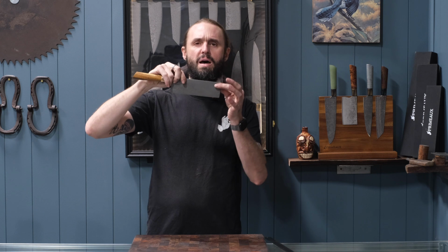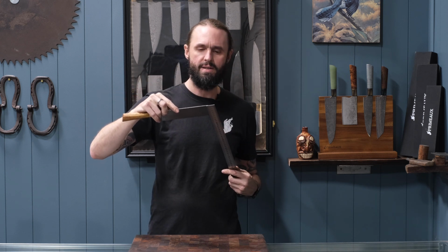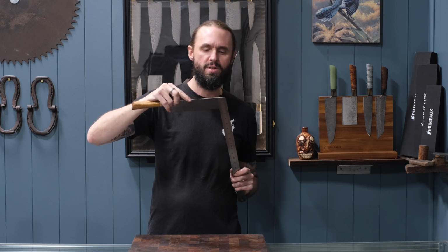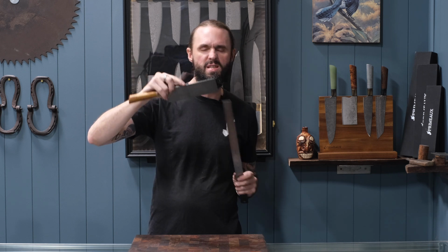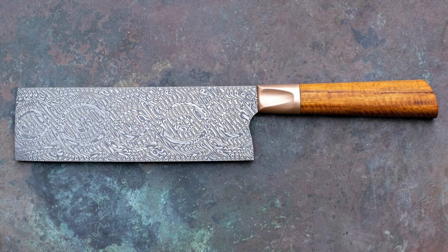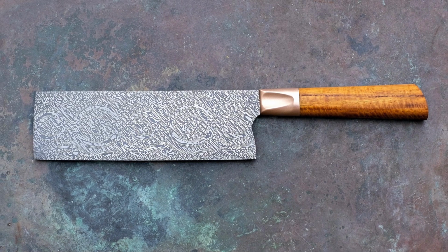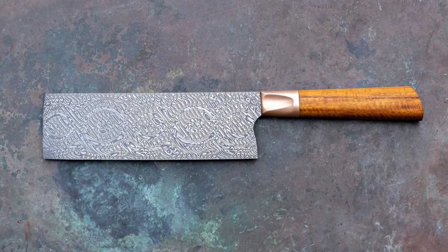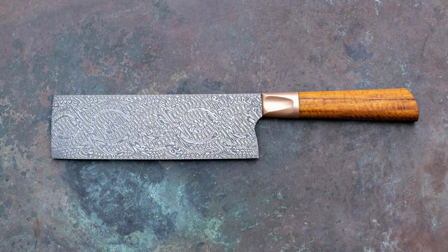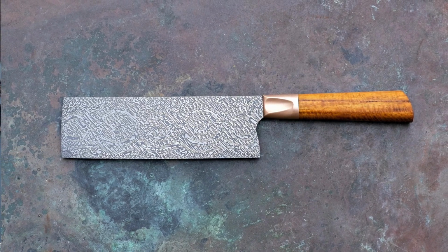And you notice it has about a standard height of most chef's knives. So in height, it's just a little bit over 2 inches, or in metric, about 54 millimeters tall. Super lightweight. This again is using about 2 millimeter stock, so it's very thin, and ground very thin as well, all the way, with a slight convex in the belly, in the middle of the knife here, which will really help with food release. I used a really cool different bolster, as I mentioned before.